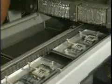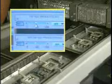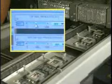For preheating, we make sure that the preheater zones maintain the relationship to the thermal profile within the tolerances set by your company. The solder wave should also be monitored periodically for wave height, the level of the solder pot, pump speed, and dross buildup.